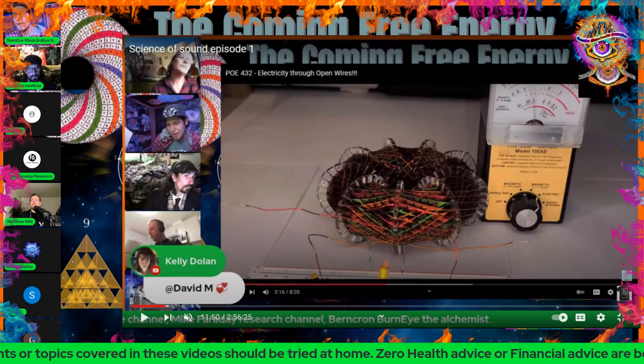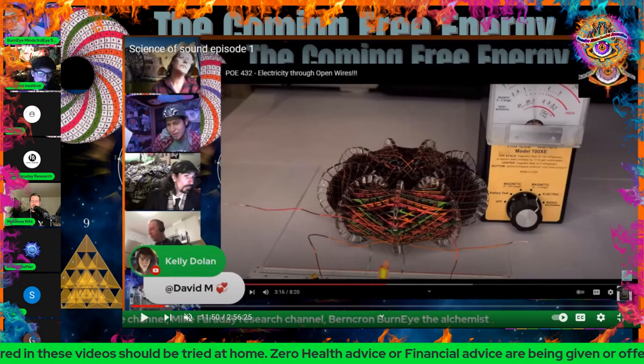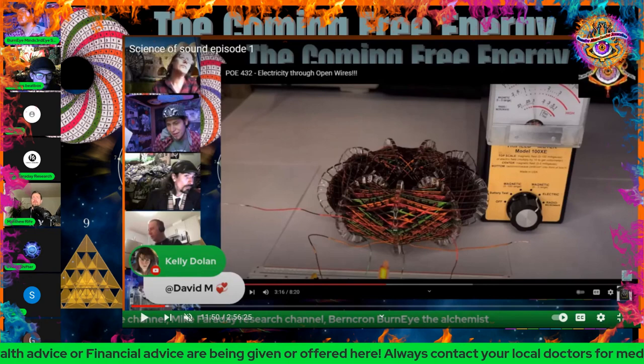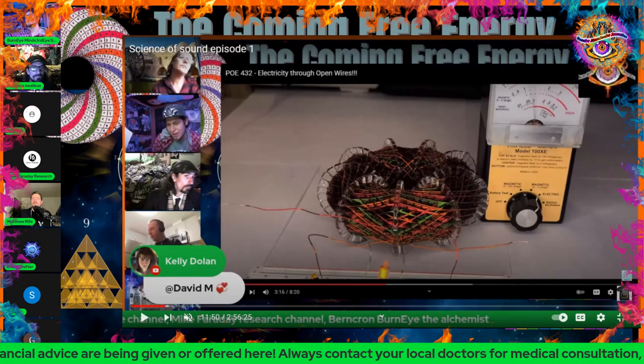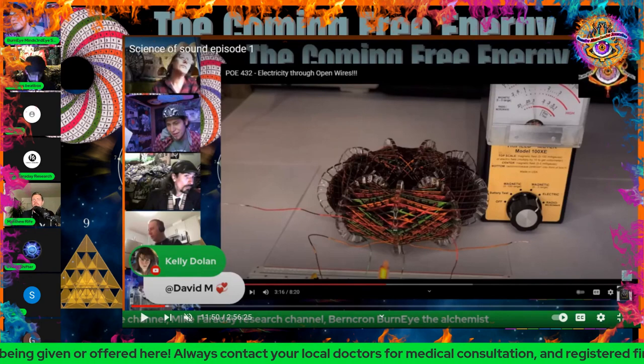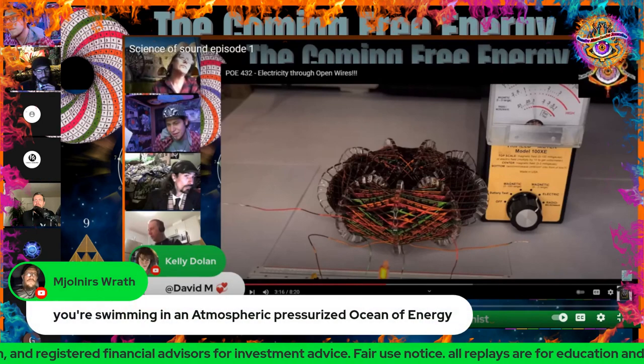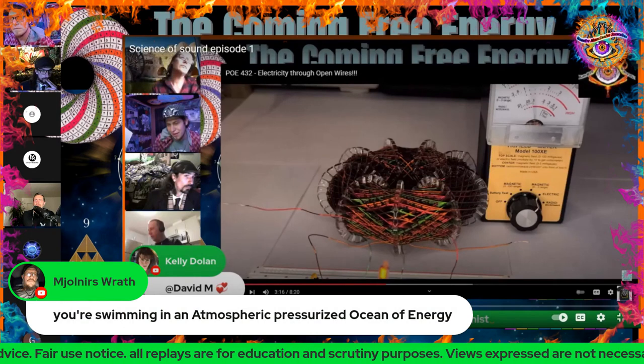I mean, it's an amazing insulator, but if it has an electrode in it, to be honest, water is a terrible insulator. That rule really only applies if you're sitting on a test bench and you basically have like 1 volt to test and you're going to check the water's electrical conductivity. It will appear like an insulator. The problem is that water happens to be ionizable. It's not one of those things generally considered, but it's obvious that water is ionizable when you think about the fact that electrolysis works. That's an ionization of water.